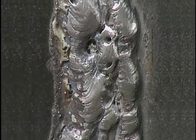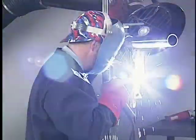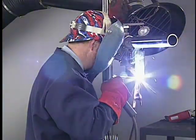If your weld has pinholes, or if your weld beads are narrow and convex, you could be using too long an arc length, traveling too fast, or your amps could be set too low. Alternate sides to minimize distortion, inspect your welds, and continue practice.